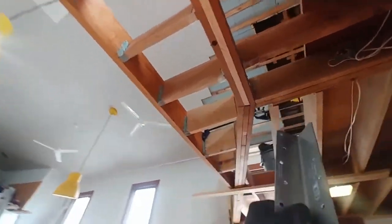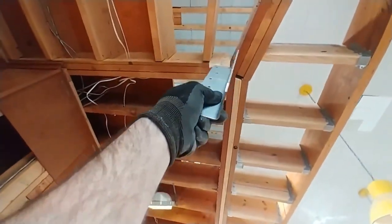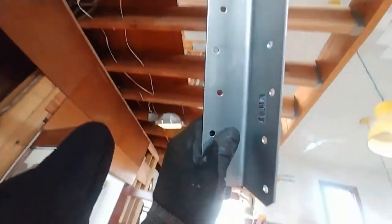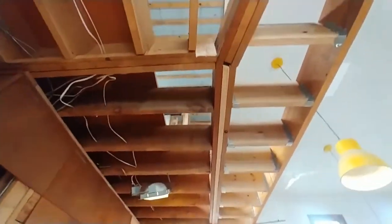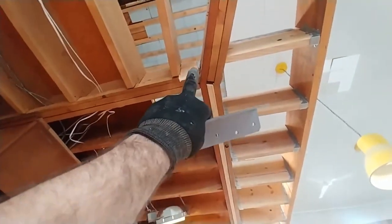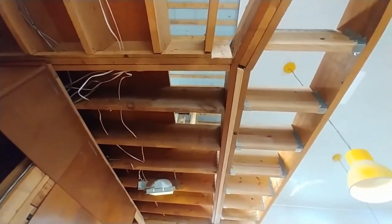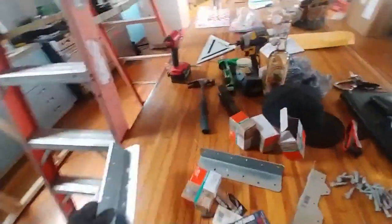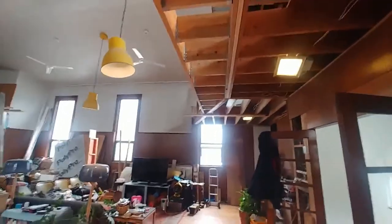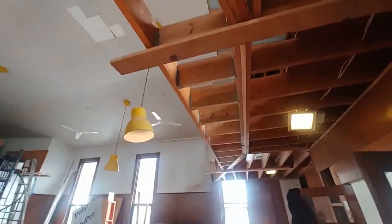So we'll put an angle in the face of it there. We'll smack one of these open and stick it on the front here. And we'll adjust another one up to fit in there. And we'll put it together with all those quarter inch screws. And if I'm really feeling frisky, I bought a tube of construction adhesive I could pump. See, that should have fit there. Just sloppy. I could pump that full of construction adhesive, but I don't really know that it makes that much of a difference. We mostly just want to put those screws and everything in one time, try not to split any lumber out, and then just count on that and the ends of this here as being the most structural something like this can get, and then finish filling in the joist layout, put some glue down on it, and put that subfloor in position.